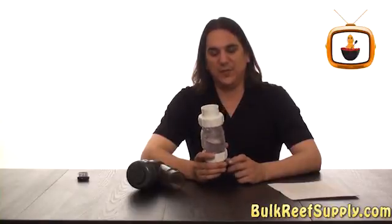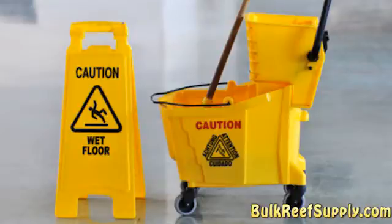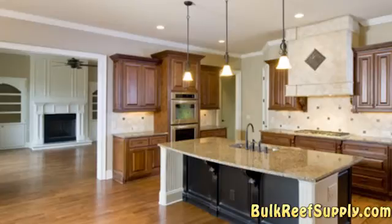It's really important to know that while a check valve is relatively reliable, they're far from infallible. If something were to get stuck on the gasket seal, it wouldn't close off properly and would leak water down. This may not be a big deal if your aquarium is in a laundry room with a floor drain. However, if your aquarium is in your living room and you have expensive hardwood floors, you may want to consider using something more than just a check valve to protect your home.